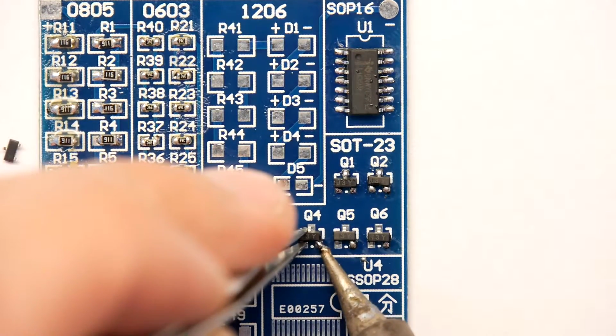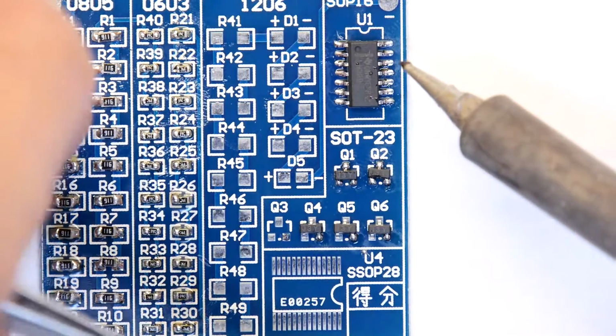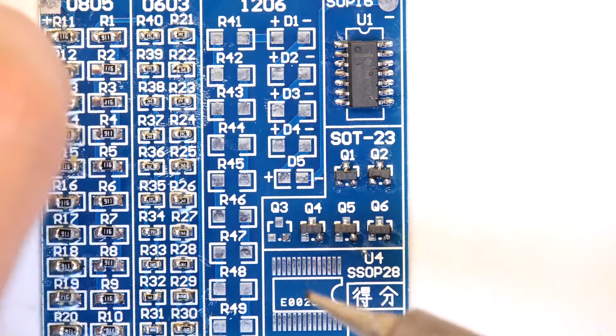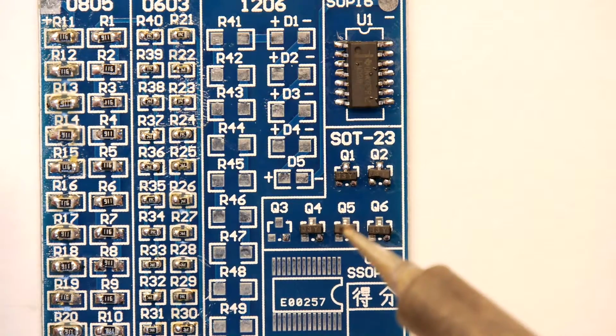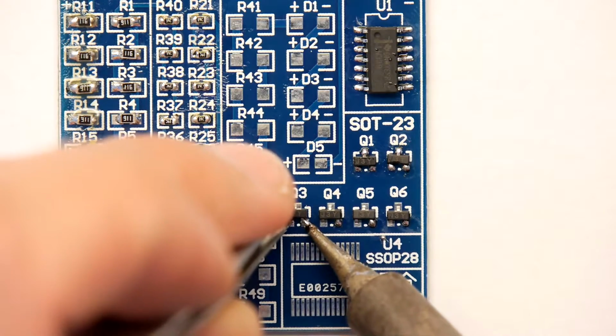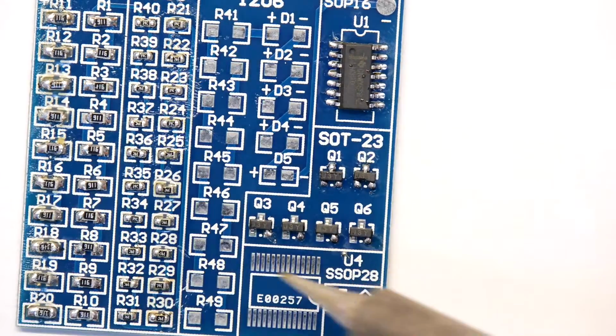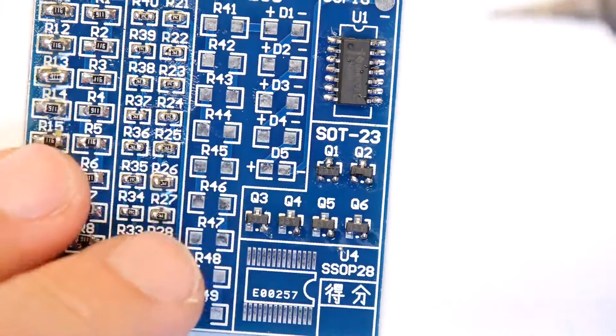component. That would have been wonderful to show you as well, because that same trick of dragging the soldering iron along the edge of the chip works for those too. The only difference is you just got to be a little bit more attentive after you've done it, just to make sure you haven't got a little bridge, because they're going to be really microscopic at that point.